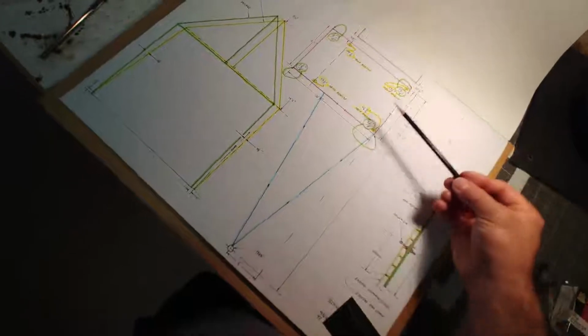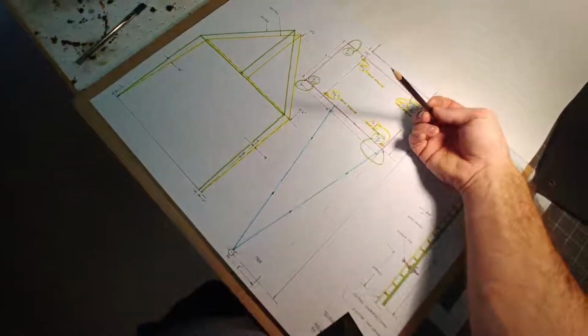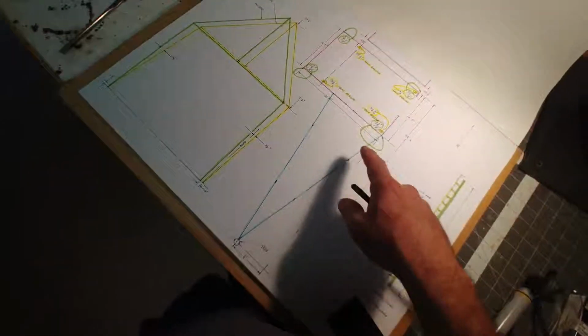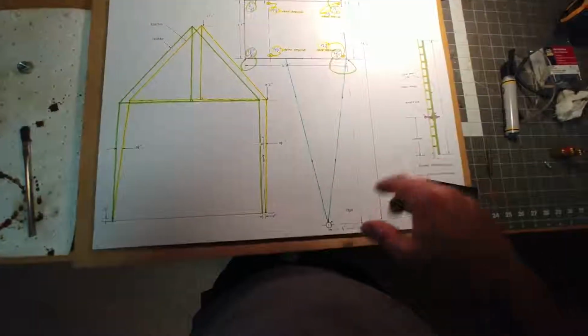You can work to the building itself and build cleats on a lower corner and an upper corner and attach them and pull diagonally within the structure itself to rack it. That's an option that we might explore as well. But for right now, this is generally what I'm going to present.